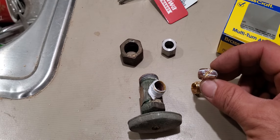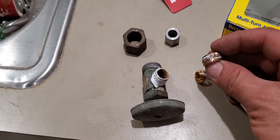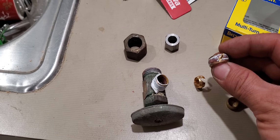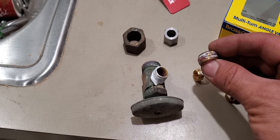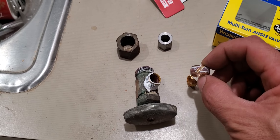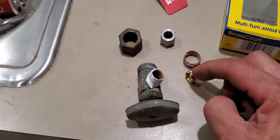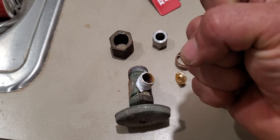Here's the piece I actually had to cut. I counted right at 60 — you can see the slit. Right at 60 it actually hit the copper pipe. So if you're going to use your Dremel, just start counting. By the time you get to 50, check your work after every pass. By the time I got to 60 — and we're not even talking pressure on the Dremel, just passing it across the ring — it broke through. Take a little screwdriver, put it in the slot, twist it, and it comes right off.